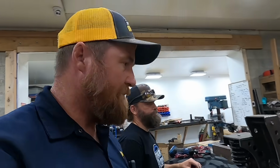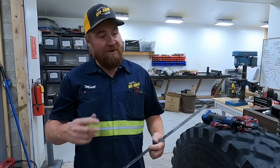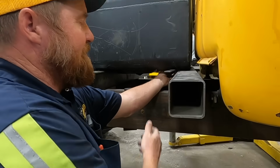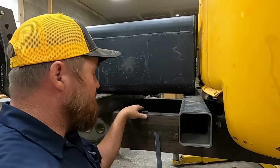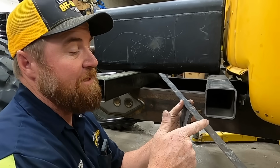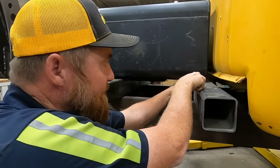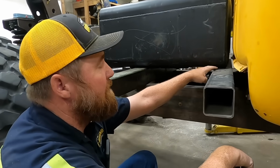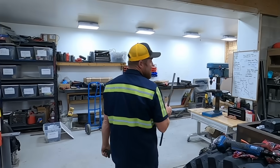I think the fuel tank is at a point where I can say it's not gonna take too much to get it on there. All right, this is not the right size of strap, but I wanna show you how I'm gonna be mounting these. I'm gonna take a strap a little bit wider than this, and weld it to the tank in places, but not like 1/2 inch on, 2 inch off. Then I'm gonna weld a tab right there. So the strap goes there, the tab goes there, and then we'll bolt the tab into the thing. It's gonna be rigidly mounted. I'll put a piece of EPDM rubber in between the tank and this, and it's gonna be just fine. Comment below on why that's never gonna work.